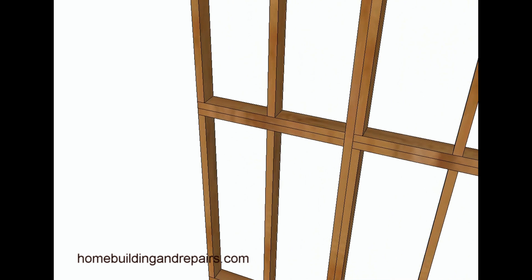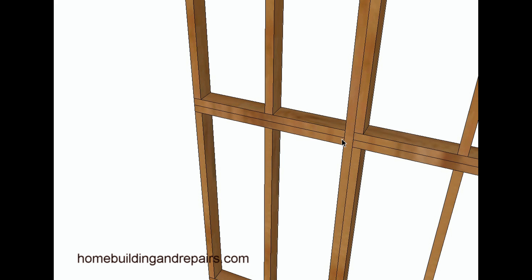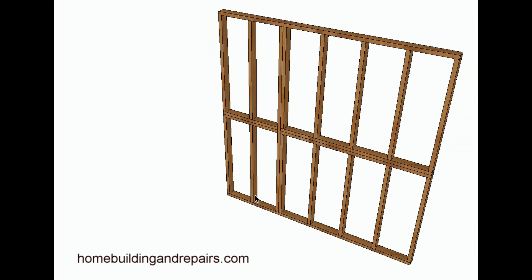You would simply cut the plates or cut whatever and put the wall stud in there, and this should provide you with some nice support. You could also add straps. An engineer might have more insight on that, but a full-length solid wall stud would definitely stiffen this wall up. You could always use a three-by-four or a four-by-four if you were looking for a little more support.